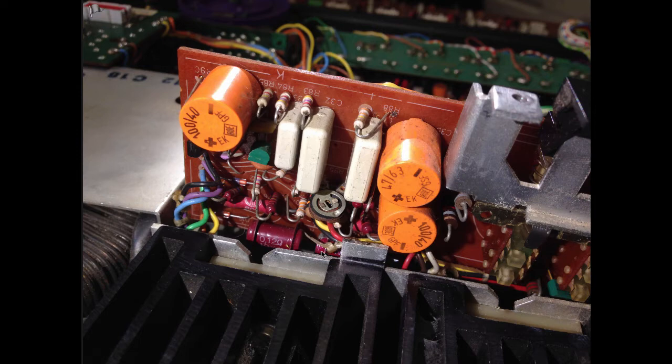These here are the two output resistors, and this one is the one that died. I decided to replace both of them because the current was most likely the same in both. If you recall from the initial circuit diagram, we have really four resistors of 0.12 ohms in the entire push-pull leg of the circuit. These here are the other two, and for some reason they use different components — these look like standard modern wire wound resistors. I decided to replace these two and leave the other two in. I also replaced the three electrolytic capacitors in all four of the stages.